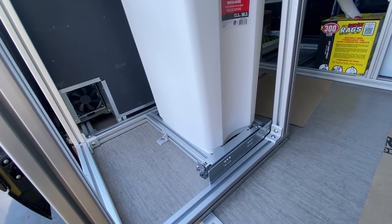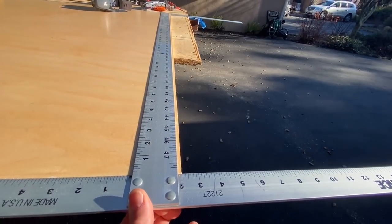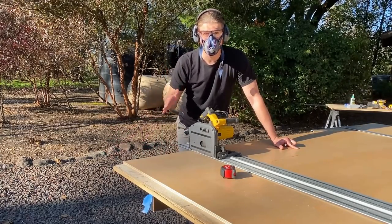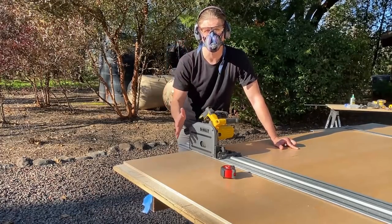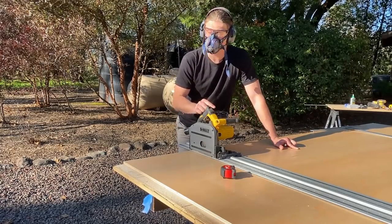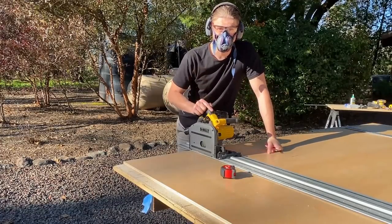If you're making drawer boxes, the first thing you want to do when you get a brand new sheet of plywood is make it square on the edge. The only big tool I'm really using for cutting all of these cabinets is this DeWalt track saw. This thing allows you to cut ridiculously straight lines with just amazing consistency. These things are pretty expensive, but I didn't have one in my first build and the difference is night and day. Link to this bad boy in the description below.